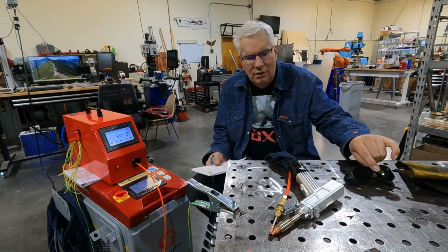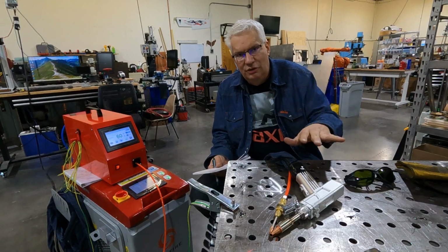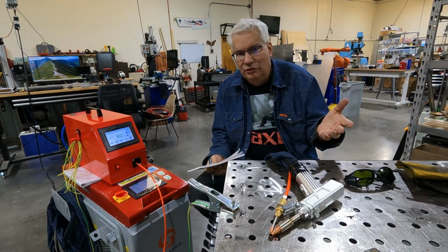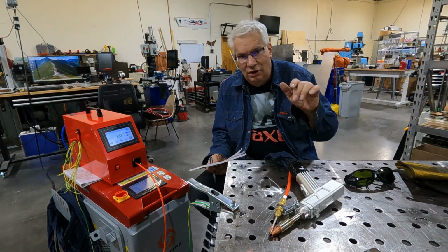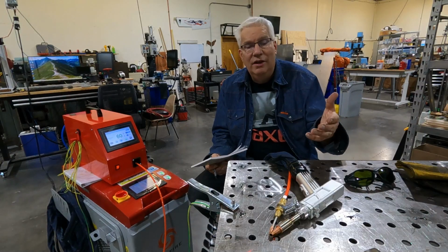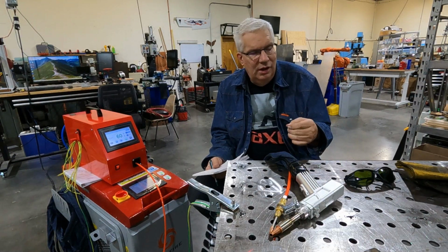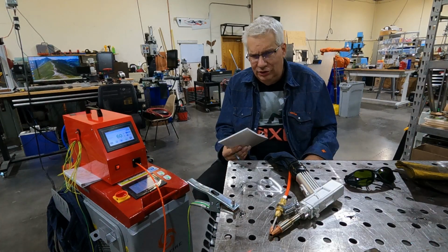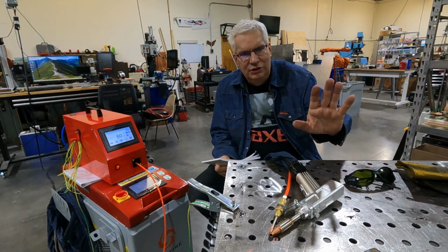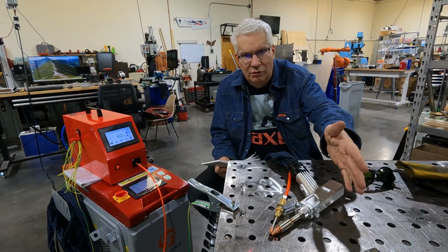When you're laser welding, like you saw, all the sparks fly away from you, and probably if there are reflections, they're also going to go away from you. So you need to be aware of that. If people are watching, everyone needs to have a pair of safety glasses. I have 4 pairs. I got 3 more additional ones from SkyFire, and just make sure that the people that are watching are not in the line of the reflection.